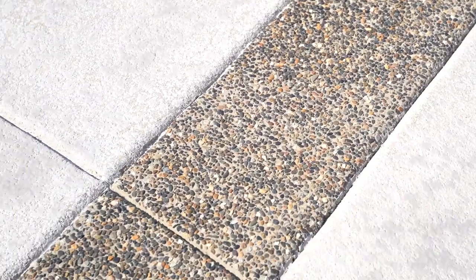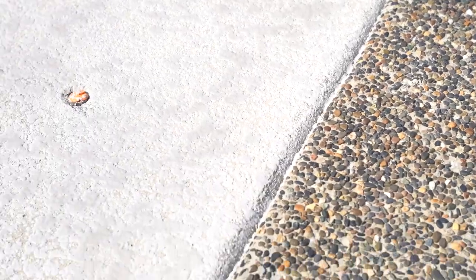Do not spray your texture unless you have an ability to seal it the same day. Don't shoot your texture and then think you're gonna seal it the next day, because inevitably it will get dirty through the night. Sprinklers will come on it. Birds will poop on it. So just make sure you can do both steps the same day.